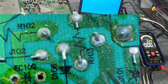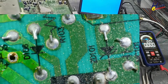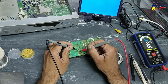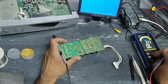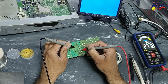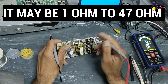— due to IC failure or capacitor failure, this resistor will get damaged. It is also a voltage setting resistor; it will adjust the VCC voltage from the auxiliary winding. We will check the VCC rectifier — rectifier is good. The resistor value reads 271 ohm, but that is not a reliable reading because it is a damaged resistor.